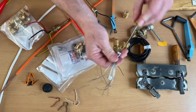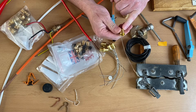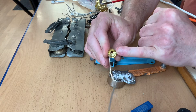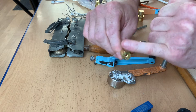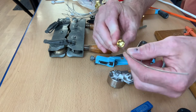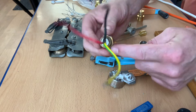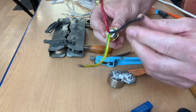These are our earth tail pots. On the side it says 2L1 - two core, light gauge, one millimetre squared - but you can see we've now got an additional welded fly lead. So we get a brilliant electrical connection off the pot, and the screwing-on process makes a good connection. The compression olive gives us this tail coming out which becomes our circuit protective conductor, rather than relying just on the body. Without the earth tail, we'd be relying on the connection through pushing it into a metallic box and tightening it off to make our electrical connection through to our CPC.